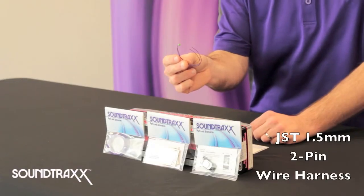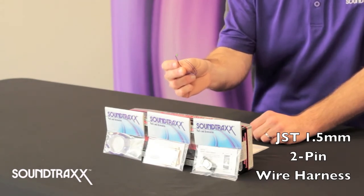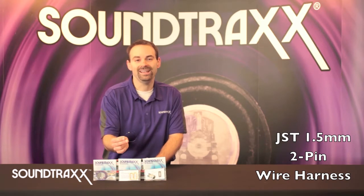Now, I also want to let you know about this handy little 2-pin speaker connector. This is a 2-conductor JST type plug that plugs right into most models equipped with an NEM format motherboard. We don't sell this part at SoundTraxx, however, we've listed a few sources in the link below the video, and we'll list them again at the end of the video as well for this particular part. It's a readily available, inexpensive part that allows you to connect right to the motherboard in a locomotive without any solder connections. Let's talk about the tools required for the installation next.